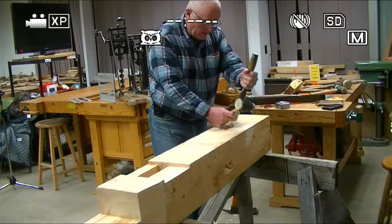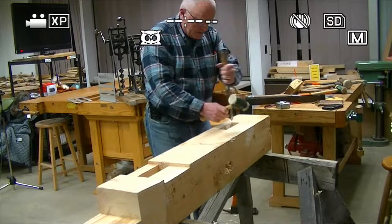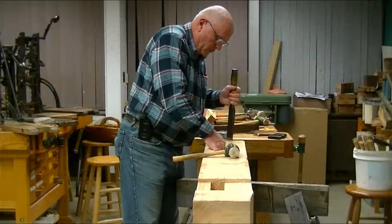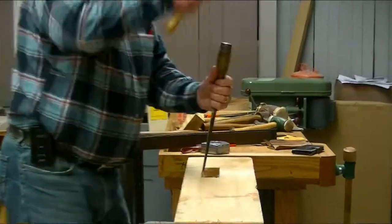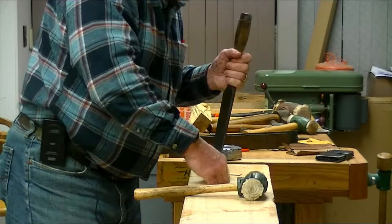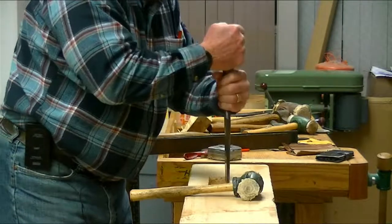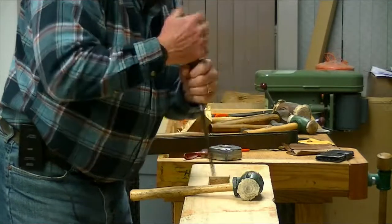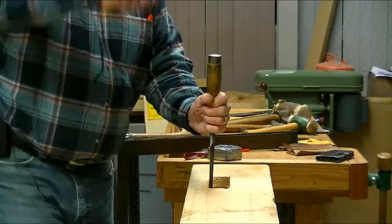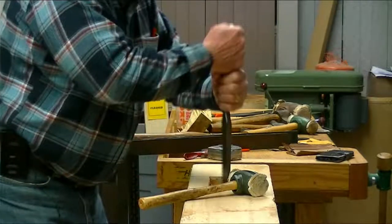Let's come back to this mortise that I've already drilled and have already chiseled a portion of. I'm going to finish this mortise now. This is a six-and-three-quarter-inch wide mortise with a two-inch bed — you've got three holes, six inches, and then that leaves a little bit of an overlap between the drill holes. You might be wondering how sharp that chisel is. With softwood, you actually need a sharper chisel because the grain being soft is a little more squashy than hardwood. Hardwood, you don't need as sharp a chisel.